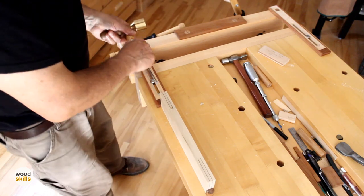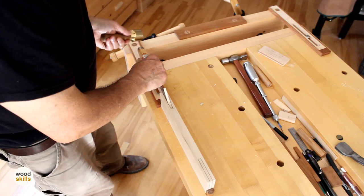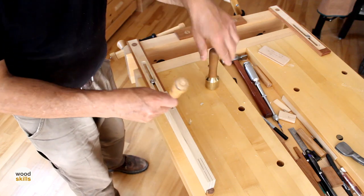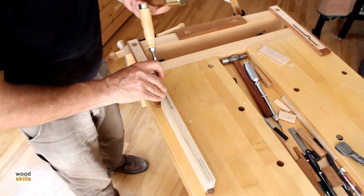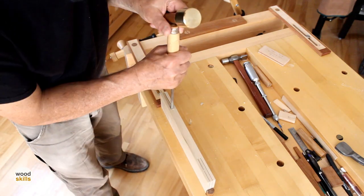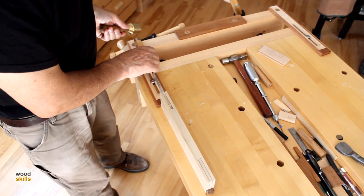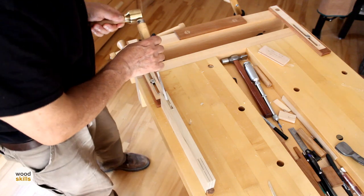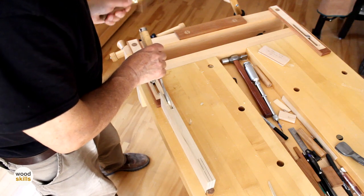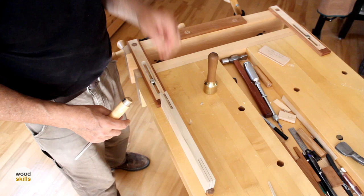Let's just keep going down. Next step is to just remove a sliver of wood. Well, that's the technique. Just keep going down. Again, you can do this different ways. You can use a coping saw and just work around and remove the complete tenon. You could start with that, but